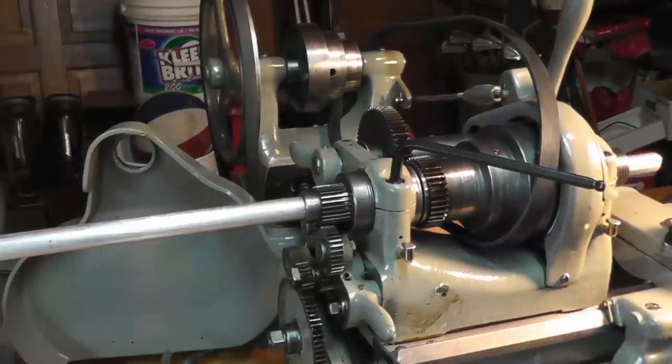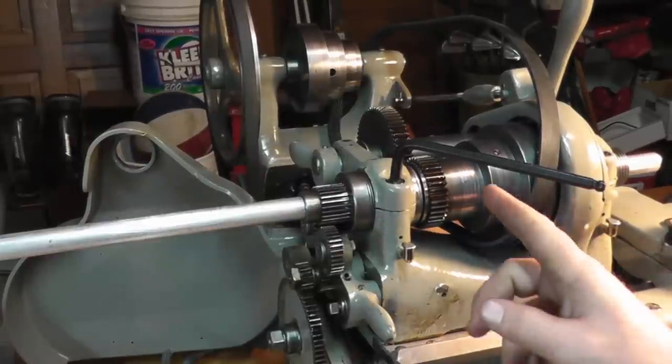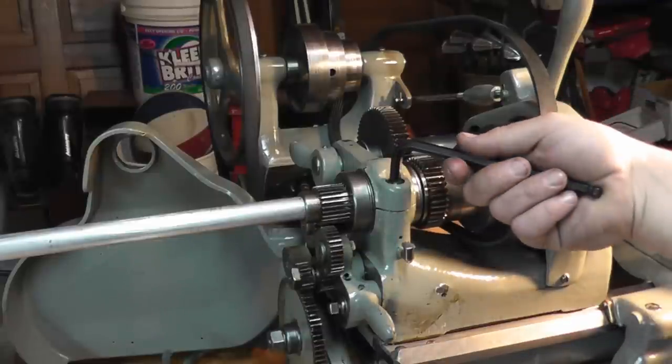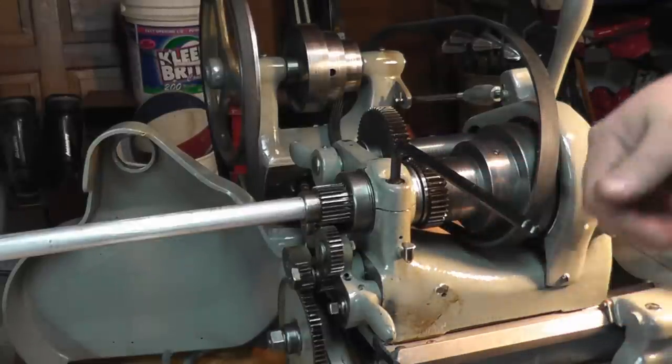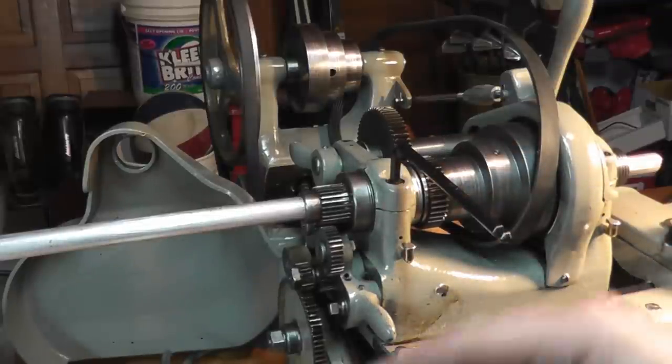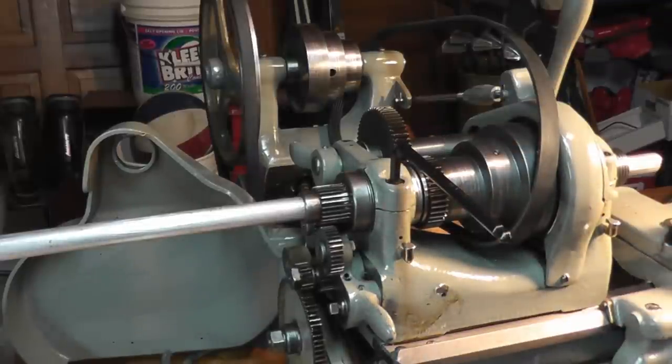Okay, I just did the test, and we're getting almost the same as we are in the front, about 1 1/2 to 2/1000ths. I get 2/1000ths of an inch with this just nice and snug. If I go dead nuts, balls tight with this thing, I get about 1 1/2 to 1/1000ths. So even though that's within spec, I do know that it's leaking oil, so I do want to make it tighter. We can go down to 1/1000ths of an inch.